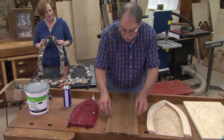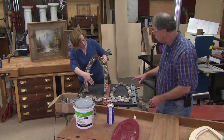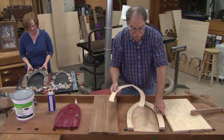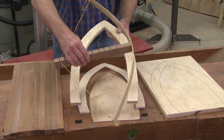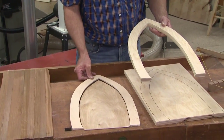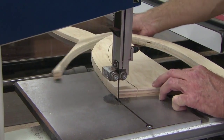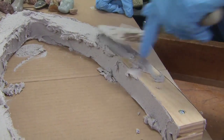I let this entire assembly of nine strips cure out, and once it's cured I can cut out the door. Susie, talk about the frame. Once you've got the door framed out, it's all about selecting the stones to go around the frame. I use thinset mortar and, just like a puzzle, get them placed in there — that's all it needs, the mortar to bond to the wood. And speaking of the wood frame, the way I create it is with a bow jig — it's just a thin piece of white oak, about three-sixteenths, with a center piece with notches to create the curves for the door frame. I make a master template, use that to create the interior door with about a quarter-inch gap around the edge, then transfer that to three-quarter-inch thick plywood. I go to the bandsaw, cut the frame out, then fasten two three-quarter-inch thick door frames together with fasteners and glue.